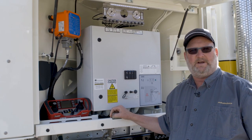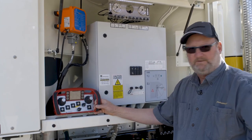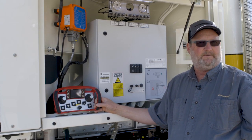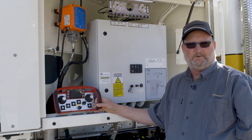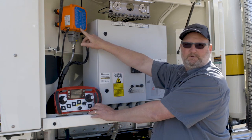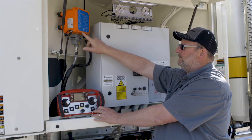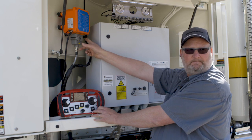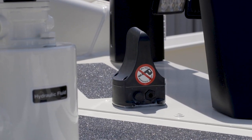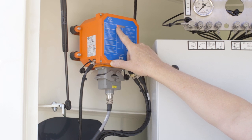Now I want to talk about the Ergonic 2 radio remote system. The transmitter is a new design. Ergonic 2 gives the operator the ability to interface with all of the functions of the truck right from the radio remote. The radio remote is communicating to the HBC 727 receiver. The receiver has a CAN bus connection, a primary plug interface, and an antenna connection. There are LEDs on the receiver to help diagnose problems in the future.